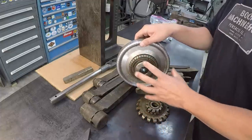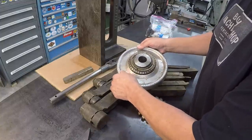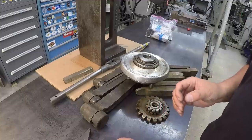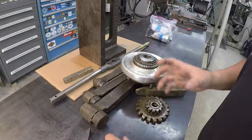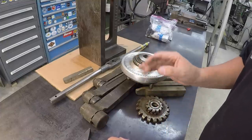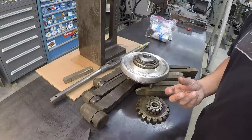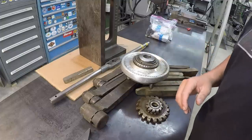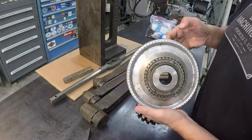But this one's nice so that I can mount it directly to the lathe and be able to use my rubber flex collets. One of the benefits of the Jacobs rubber flex style is the collets have an expandable range, so they're not just fixed to one specific size. They'll bridge the gap between, say, a quarter and 3/8 of an inch, 3/8 to a half, something like that. So you've got a wide range. When you're in a shop like mine where I don't necessarily have metric collets for metric sizing, you can go to a rubber flex collet like this and normally be able to hold something if you're wanting to hold it in a collet. So I had to pay up for this one a little bit more, but still a good price,